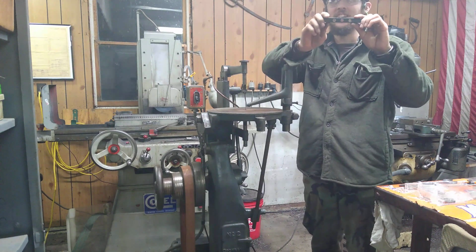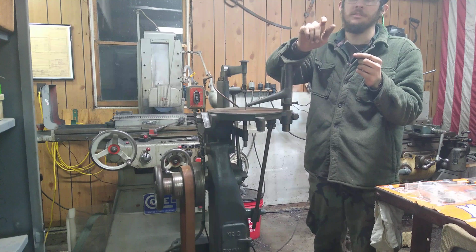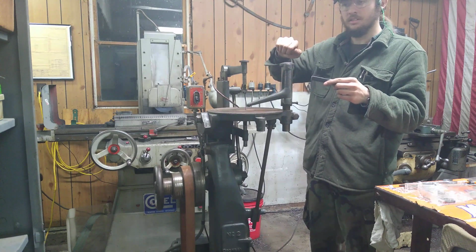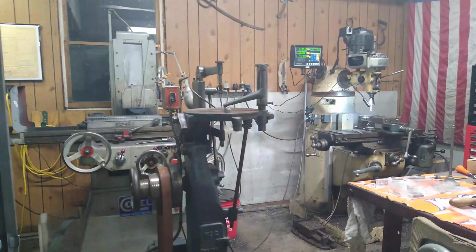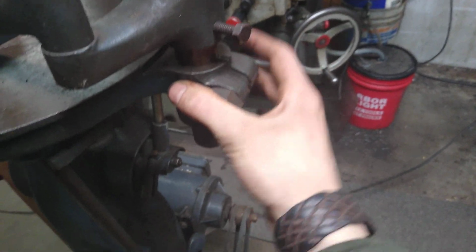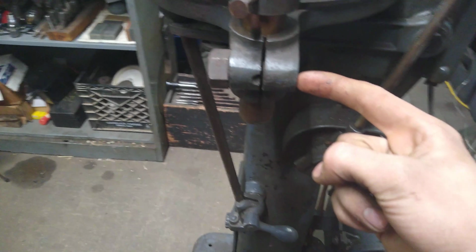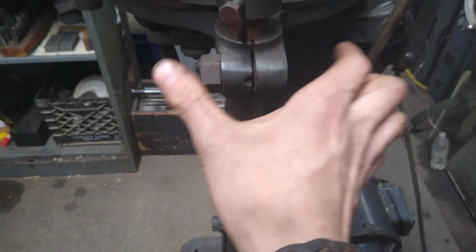Every time. Anyways, a split clamp is kind of like a collet, but there's one slice in it. There's one right on the side of the machine. I'll show you that. This guy right here is a split clamp. It's like a solid thing with a hole in it, and there's a cut relieving into that, and this guy is threaded, and this is just a through hole. So when you tighten this bolt, it pulls the threaded section and mushes it together, and that's a split clamp.